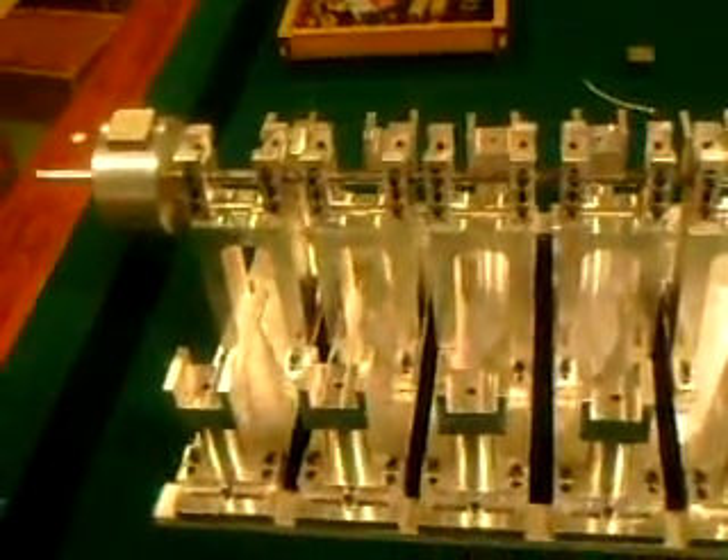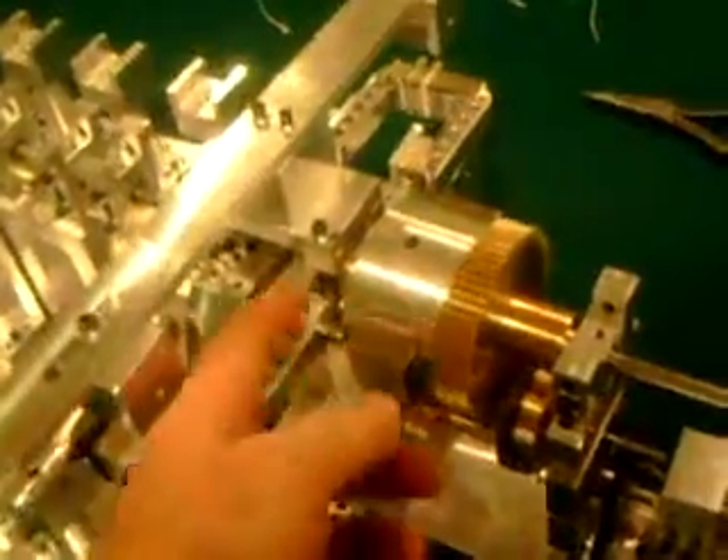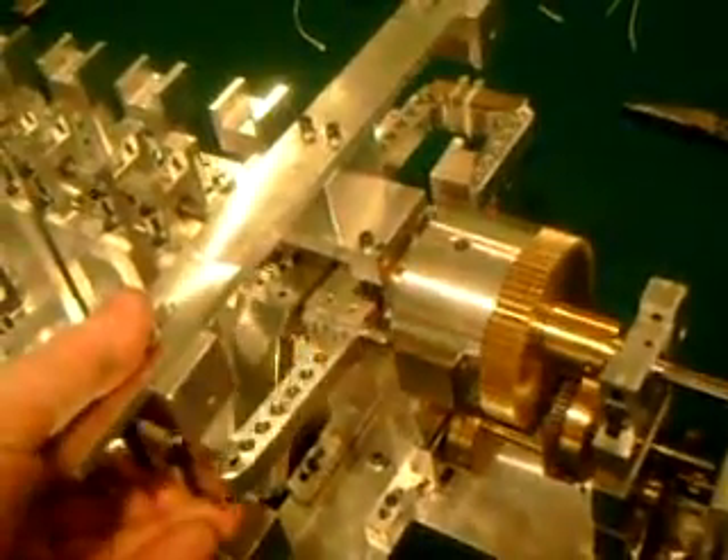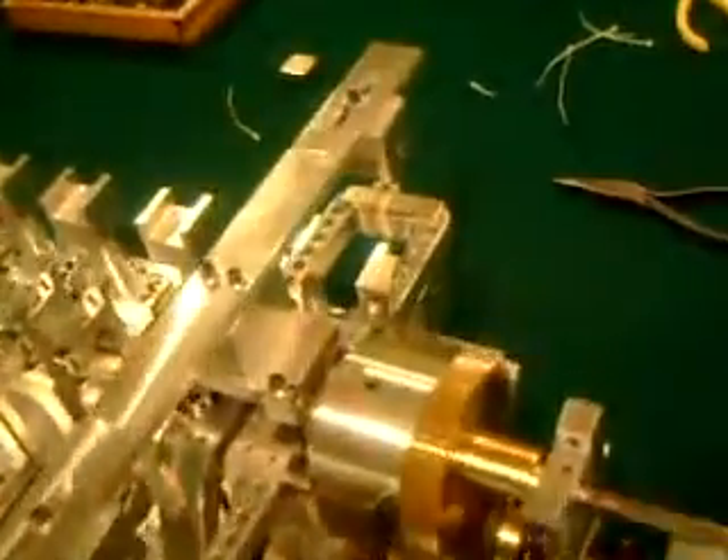You're going to have to have different power magnets, because you need stronger magnets right where the lever arm kind of kicks in — to get the motion going, and then it feeds these other ones all the way down the line. But you don't want them too stiff on these other magnets, because if you get them too stiff, it's not gonna transfer the motion and it's not gonna have that wave effect. So this thing's a little more sophisticated than what it seems.